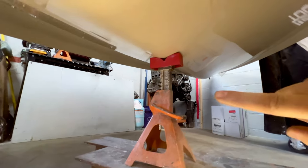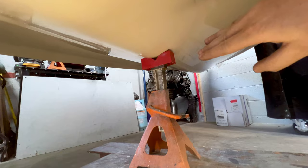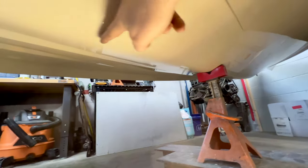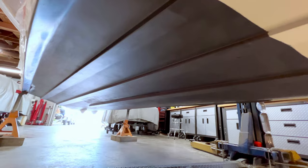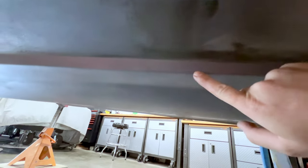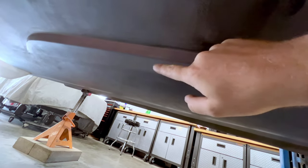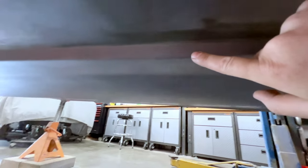I did pull this jack stand back about two feet and then I was able to crawl up to the front of the bow, finished polishing up there, blended it in, and also just took the opportunity with the boat off the trailer to polish the bottom side and get all the staining and everything cleaned up. There's no more bare areas - this was pretty bare all the way along - and now it's all watertight and sealed up. The bottom side of the boat is black with the speed coat. Back here on this edge - this is where I had most of the damage on this lifting strake right on the corner. There were a lot of big chunks, pretty moderately into the fiberglass, clearly all the way through the gel coat but not structural. That was one of the main things I wanted to chase and get taken care of. We took care of these with the fiber filler, filled them up, sanded them down, then gel coated over them, blended them all in, sanded it down, and now you can see that it's completely uniform and free of any damage.